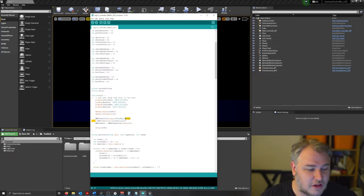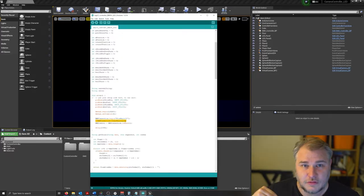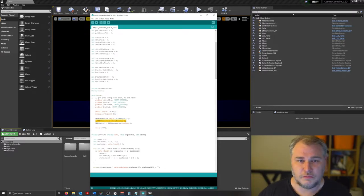Now we've got this clear pairing commented out. This became quite useful if we struggled with connecting with the Bluetooth low energy device. If we did a clear pairing and connected the first time, the camera recognized the controller, and then the controller would recognize the camera. And if we flashed it again with that commented out as a secondary thing, it wouldn't have any issues with the pairing side of things in the process. So that's what that does.